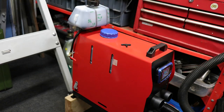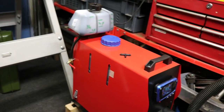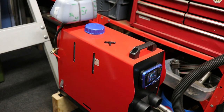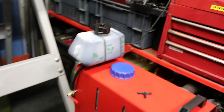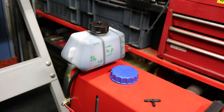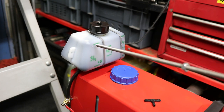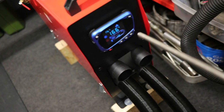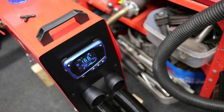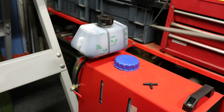I got this tank off Amazon — there's loads of different types, I just wanted some vessel to hold fuel. If you notice, I put some markings on it. This mark here to here is when, on the front screen set to level three, it gave me three hours. That's three segments on the front — six in total — so that gives me three hours on level three. Not too bad considering it's only a small tank.